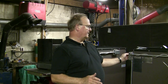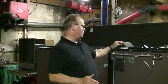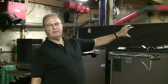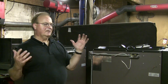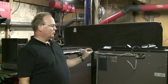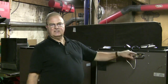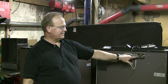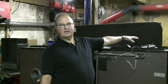The only other thing you're going to have to wire is your high temperature probe. That does get wired in and it's on your wiring diagram. Your high temperature probe would be in the rear corner of the plenum. Your low temperature probe is actually right here — I took the cover off. These wires are not directional, so basically this is an on-off switch.